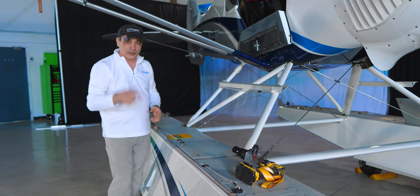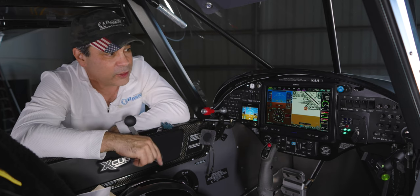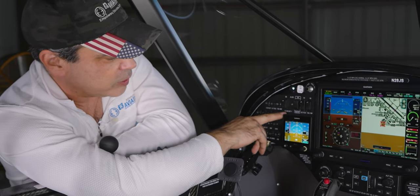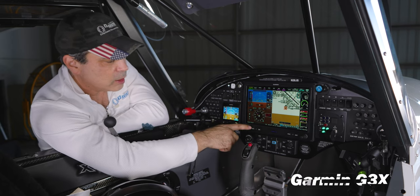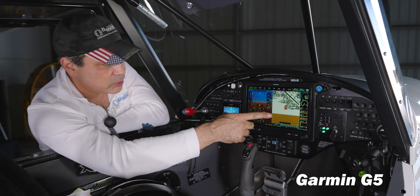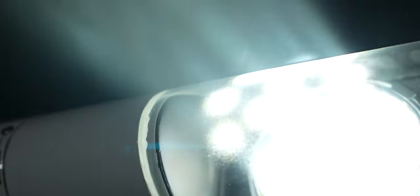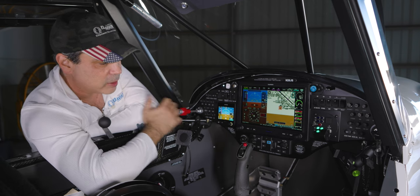Let's jump inside the cockpit. We have everything except for the second GPS. We've got our controls here — constant-speed prop, throttle, mixture, breakers, master switch, ignition switch. After startup we turn on the alternator, ignition, and fuel pump for takeoff and landing. We've got the Garmin GNX here with XM weather and XM radio, and our Garmin G5 backup. On the other side we have lighting switches, pulse lights or strobe lights, breakers, avionics master, and nav lights.